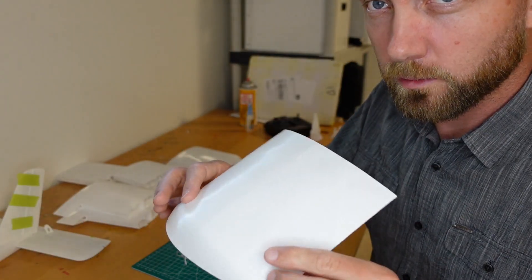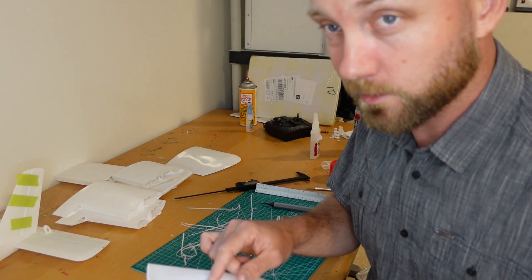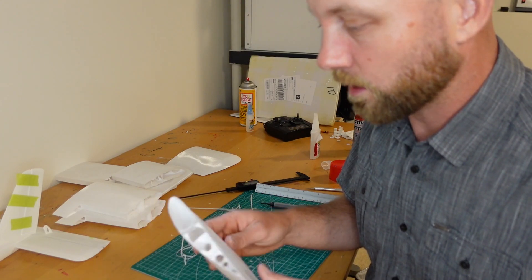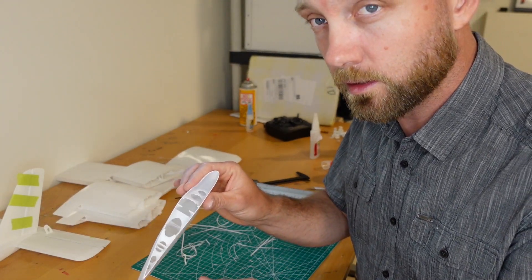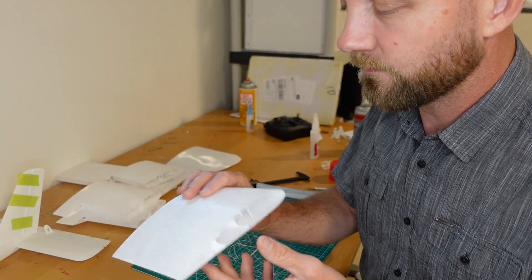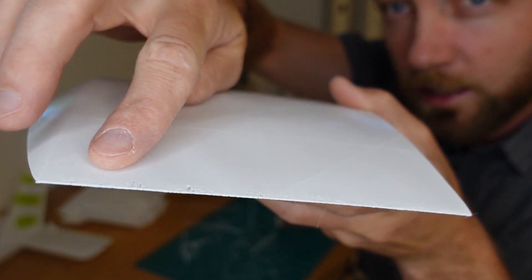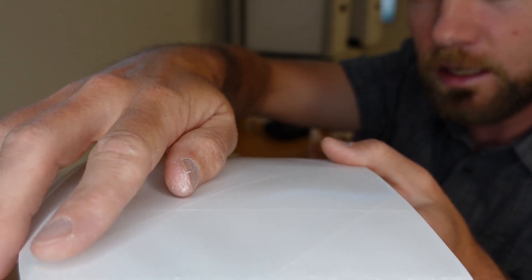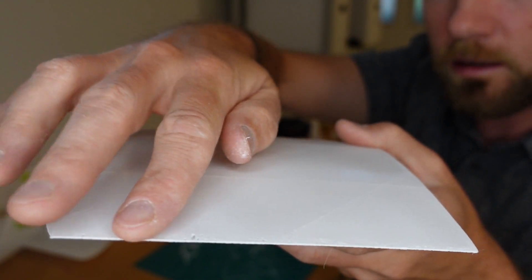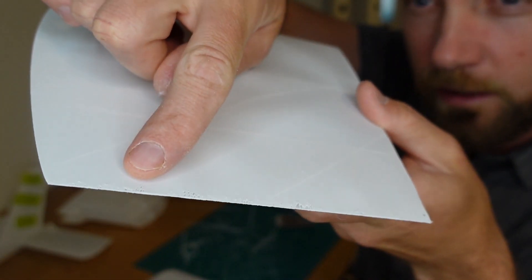We got all the brims off the PETG wing pieces. Getting the brims off PETG is much more difficult than PLA but it does come off with a bit more effort. Working with these PETG pieces, I can definitely tell they're much more flexible than the PLA ones. I also found a couple of spots where they didn't print out perfectly — on the trailing edge of the wings there's a little bit of under-extrusion. Adjusting the extra prime amount in print settings might have fixed this — something to watch out for on your prints.